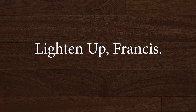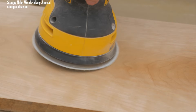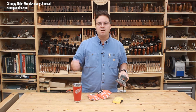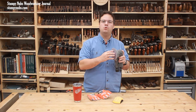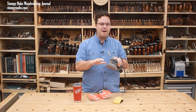A lot of people think if they push down harder with their sander, it's going to work faster. And sure, if you're really focused on the edge, you can sand a little spot aggressively. But you're causing an uneven surface and it's going to stand out like a sore thumb when you put your finish on. Applying too much pressure also interrupts the tool's random orbit pattern and reduces it to just simply vibrating.